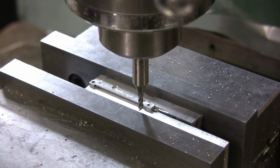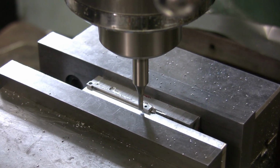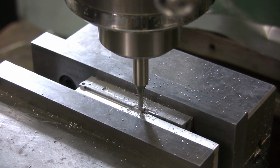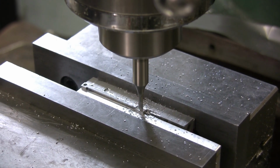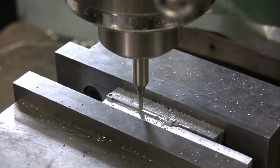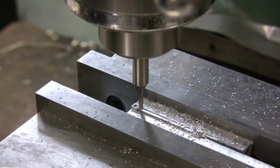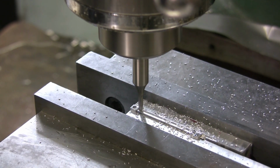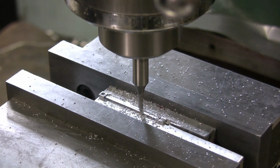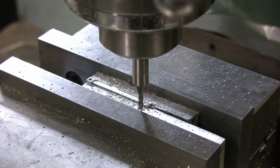And I'm gonna adjust down my 15 thou for the first side. And we'll cut the first side here. I just go around and do the end here first. Okay, so now we'll just buzz down it to the other end. It's an 1/8 inch end mill I have in there. And we want to line up with the 2 little flats on the sides, and then go back and finish it. You got to take it easy in the middle there, because the middle is loose. It's just gripping on the 2 ends. Okay, so now that's the first side.